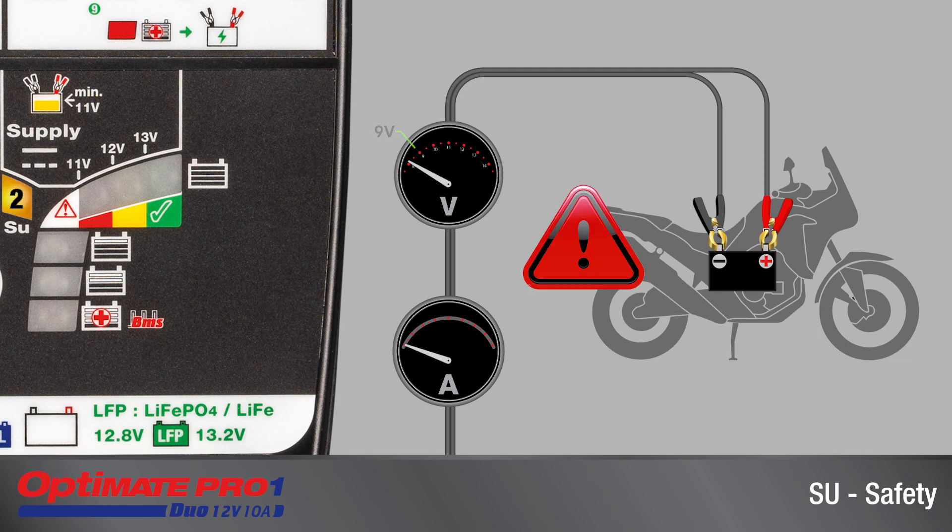If the SU LED blinks while LEDs 6, 7, and 8 are off, a fault condition has been detected. This might be a reverse connected battery, a short circuit or overload, or AC power interrupted during SU mode. Correct the fault condition, then push and release the push button. Output is restored when LED 2 turns full on together with LEDs 6, 7, and 8.